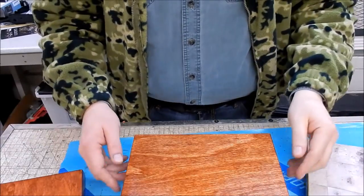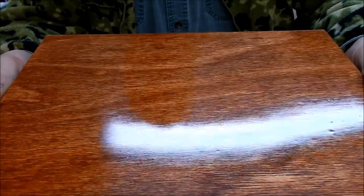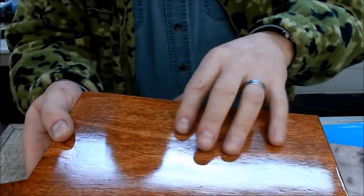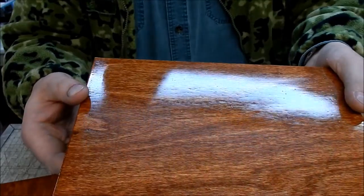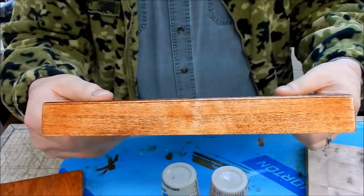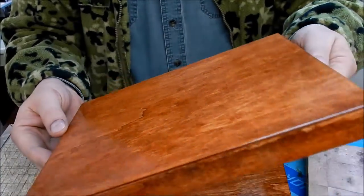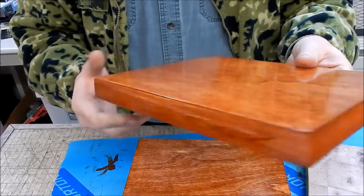Okay, we're back and everything's done. This is the second base we did. If you look really close you can see there's some dimpling still - that's from when we took the steel wool over after the stain had dried and took the softer wood off that would swell up once we put the top coat on. This is with two coats, so I would probably give this a light sand and put another one or two coats on to seal that up and make it nice and smooth. The sides turned out quite good despite being a little on the light side. The first one we did - I cleaned it up and it turned out gorgeous, really nice, same with the edges, although there's some spotting which I'm sure is from the gluing process.